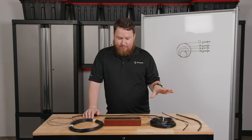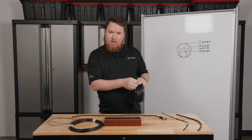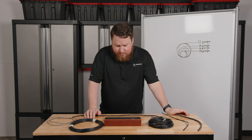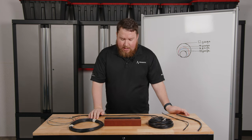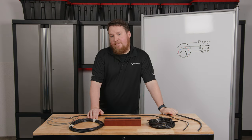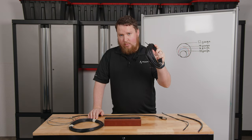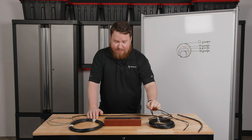Typically in a 70 volt system, 16 gauge is the ideal wire for most applications. It's thick enough to maneuver — you can pull it through a conduit — and it has enough conductors to deliver a decent amount of wattage to the speakers. There is a chart from wire manufacturer Belden that we'll reference in the comments below. It basically calculates that a 16 gauge wire in a 70 volt system can run almost 10,000 feet before incurring even a 3 dB loss of volume — that's almost two miles, and it's relatively cost effective.